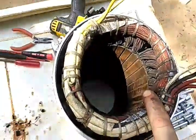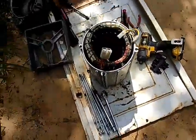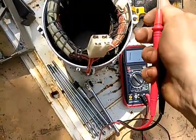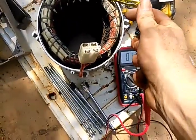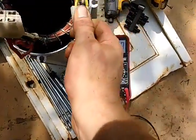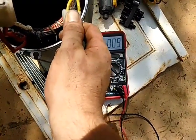I'm going to get my drill and wire brush attachment and clean all this up, get this put back together. But before I do that, I want you guys to see what the readings are. If you don't have these readings, then you don't have a good alternator — or generator. It's technically called a self-exciting generator head. You should have a resistance of three times whatever is between your field wires and your collector coils.